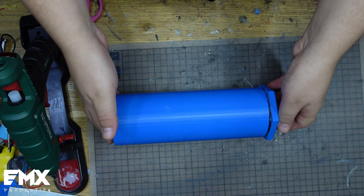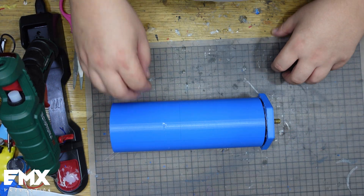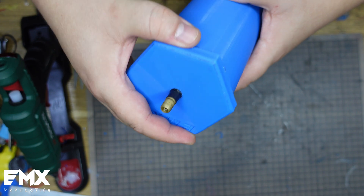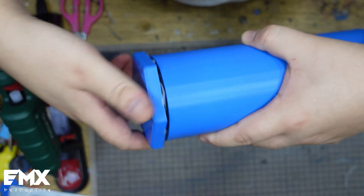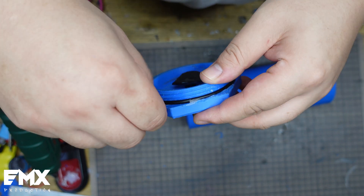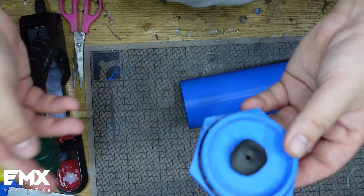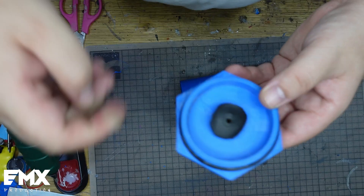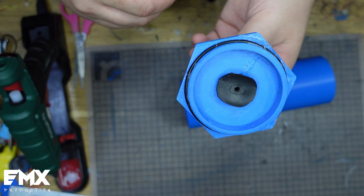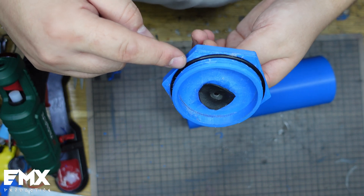This is actually supposed to be a tennis ball holder — to pressurize it at 26 PSI so the balls keep their inside pressure. I think I have to redesign the cap because I had an indentation where the seal is supposed to sit, but I did a TPU seal and it never worked properly. Maybe if I make it flat and then seal it, that will seal better. In the next video we'll try the TPU seal on the flat part instead of inside the indentation.